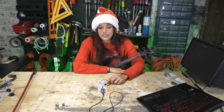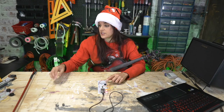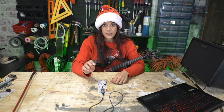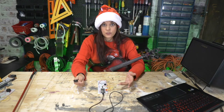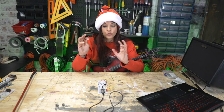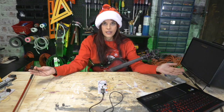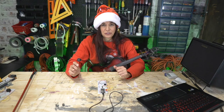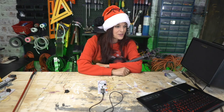Yes, and Bounty Hunter is noting the new ringer, or our new buzzer. That's because earlier, if you watch this back, we played Jingle Bells with our regular active buzzer. The problem with the active buzzers is they're great for being annoying and alerting you that something is wrong, like your hot water heater is leaking, or somebody put their hand in the cookie jar, that kind of thing. But it doesn't have a big frequency span, unlike our passive buzzer. That's why I swapped them out. The active buzzer also has a much more dirty sound. This has a much more classic MIDI sound that we're used to. So that was a pretty good switch.